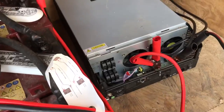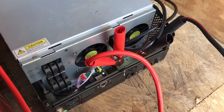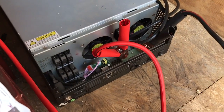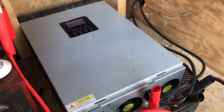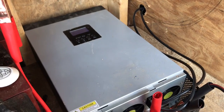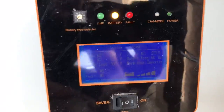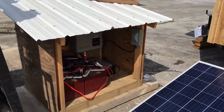Another thing you can do — and most people won't have two all-in-one inverters lying around — is use one all-in-one inverter's battery cables to jumper off a 48-volt bank if your charge system went down in the other inverter. You can use it as a charge controller. So I've shown you multiple ways to get a solar system back online should extreme weather have killed it, a deep discharge occurred, or a DC load was left on too long. You can see right there we've got it charging off the solar onto the batteries.